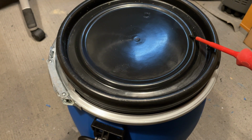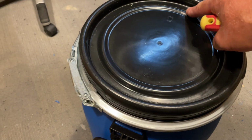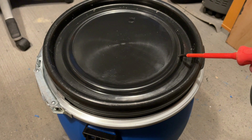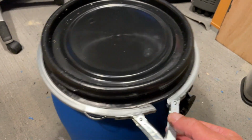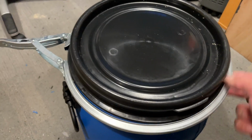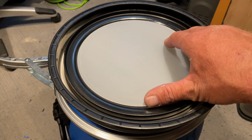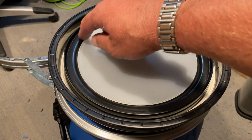On the opposite side of this lid, within the valley on the inside, there's a ridge all the way around. I filled that ridge with CT1 because, since building the pond, it's my go-to brand. I use the high performance heavy thick strong CT1 to form a bed for the Perspex to then sit on. Once that valley is filled, the 20cm plate fits nicely inside it. Not only that, but you get a lip of CT1 coming out, which you can see and be sure that it has formed a seal.